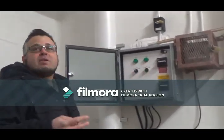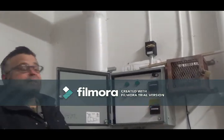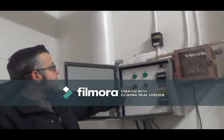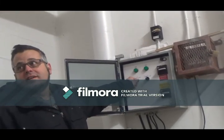Maintenance-wise, every 3 to 5 months, we recommend you drain the pit and take a look at the bottom to see if there's any debris buildup. Manually? Yes, you put it on hand to bring it down by hand. But you cannot bring the water below the pump, because if you suck up air, you're going to clog your line.